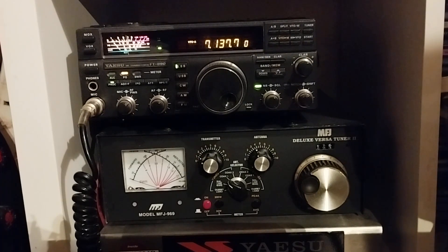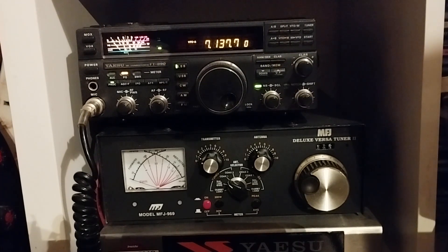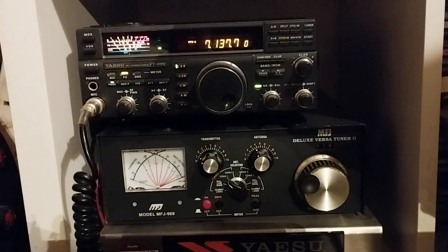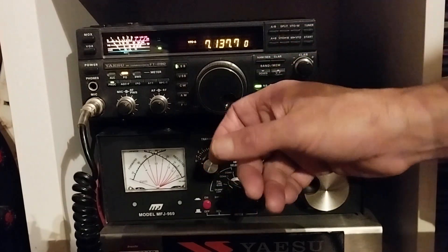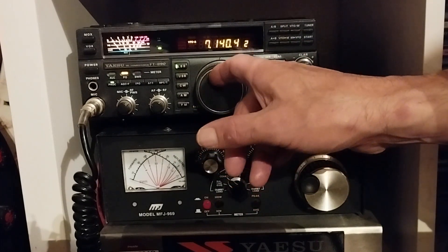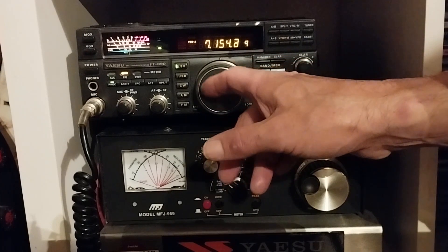The Yaesu FT-890 fits nicely in the record cubicle. Below is the MFJ 969 manual tuner roller inductor — I've had that for a number of years, imported it from stateside, actually worked out a little bit cheaper back then. That's my first HF radio, the FT-890 from Yaesu — brilliant piece of kit. Currently plugged into the homemade delta loop intended for 20 meters, but right now it's a little bit longer so it's kind of multi-banded. I'm just tuning it — it's about an SWR of 2 on this band, brought it down with the manual tuner. I'm not going to be transmitting tonight — I'm going to tune it up properly first.